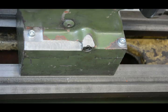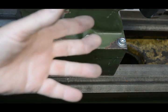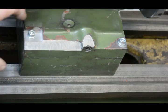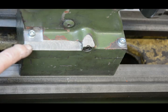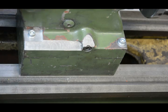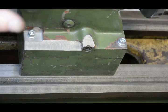I've been using a lathe for around about 60 years, and in all that time I could probably count on the fingers of one hand the number of times I've wanted to offset the tailstock in order to turn a taper. So I'm not too bothered about this being clamped permanently in place. If I ever did need to turn a shallow taper by offsetting the tailstock, there's nothing to stop me removing these bolts and I'm back in exactly the original situation.